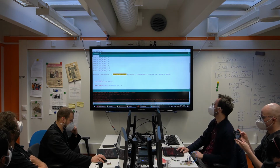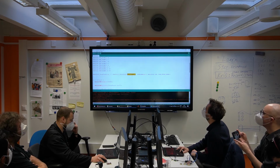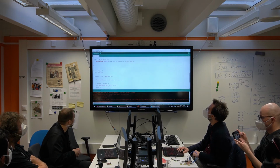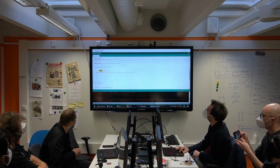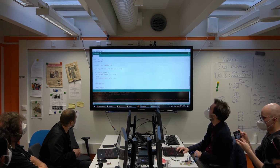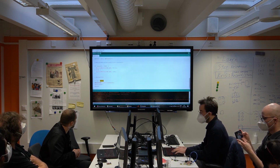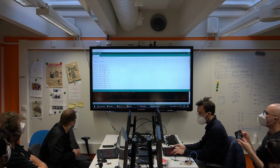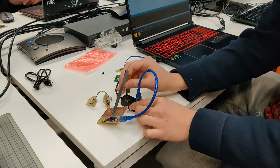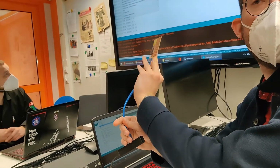And it's simply set up like this. I have to set up one Adafruit FreeTouch object per capacitive pin. Right now I only have one. And then you have to set it up, begin, it could fail. And then measure, and you get the value. So, you know what, let's go to debug instead of the final application. And again, I can now remove my programmer. It has done its job. And this is a standalone chip from now on. It's like a little Arduino.